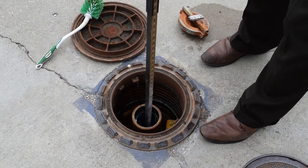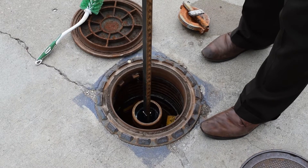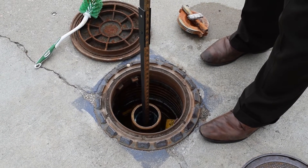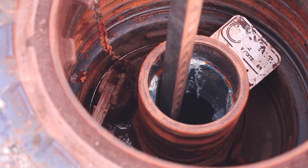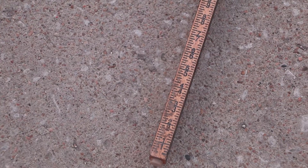How many UST operators still use this type of tank gauge? UST operators have been sticking tanks for almost as long as there have been USTs, so today we'll demonstrate how to stick a tank. They did it at first to see if the tank had anything in it, then to see how much. As time went by, they made larger measuring sticks marked in inches. Now the stick has to be marked an eighth of an inch so it can be more accurate in gauging how much fuel is left in the tank.